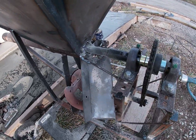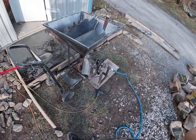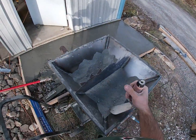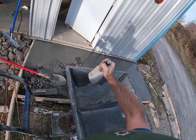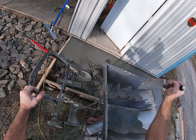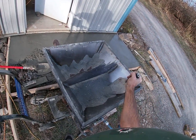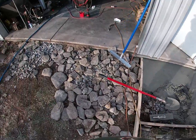The modification made inside the hopper really helped to reduce leaking coming out of the back of the auger screw. And that little chute really worked good — for any that did come out, it went away and didn't go on the chain and sprocket anymore. Real simple solution did the trick on that little issue.